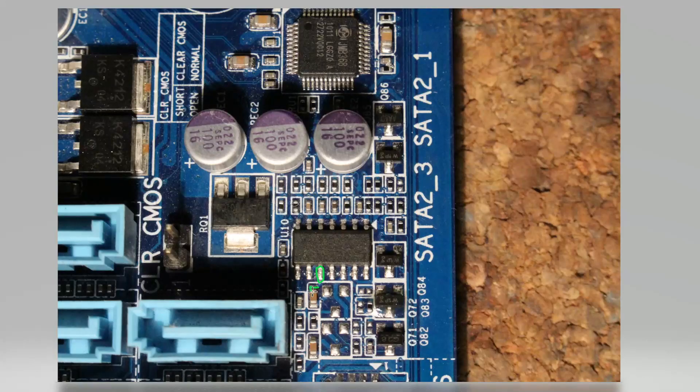Okay, let's move on to the VPLL mod. This is the pin we want — you can also grab it from here. From there you want your typical variable resistor to ground. Value-wise I would suggest using something like 50 to 100 kilo ohms. You don't want to use anything too low here because then you're always running really low PLL. I use 50k personally.